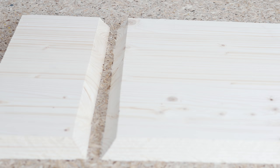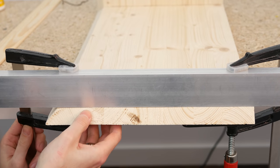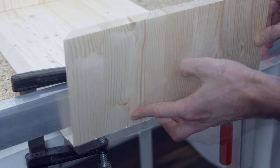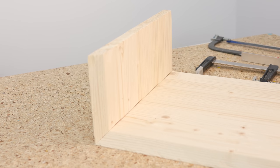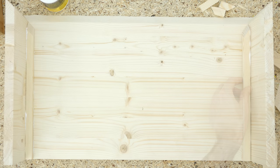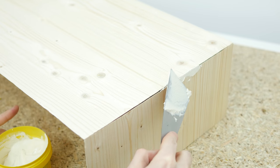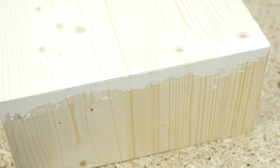After cutting the top piece, two side pieces and the front, I proceeded with gluing the box together. I don't have all the proper tools so I had to improvise with clamps and whatnot. I glued in a few wooden supports to ensure that the construction won't collapse under the weight of the monitor or my cat. After the glue had settled, I filled in the cracks and left it to dry. When the filler dried, I sanded the surface a bit and stained it.